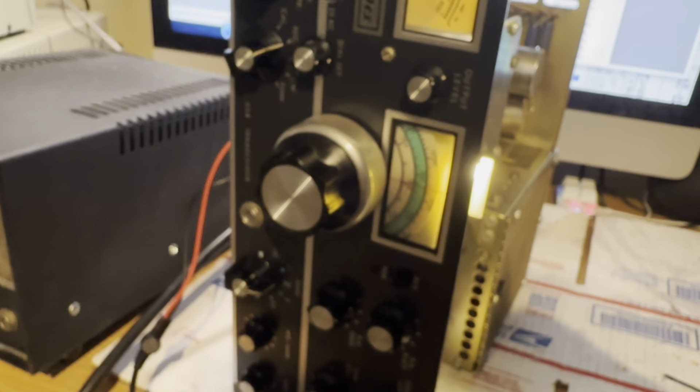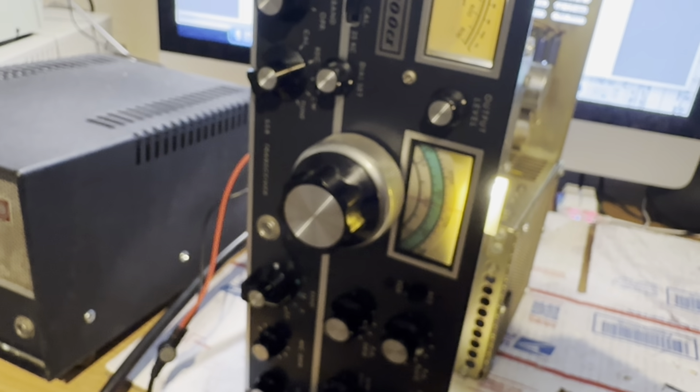Next step: we've got 1500 cycles going in. Adjust the gain of the audio generator and the mic gain to get 10 to 15 watts — I'm going for 15 watts. Back here to transmit, taking up the mic gain to 15 watts. I've got audio going in and I've got the receiver on too, monitoring the audio.